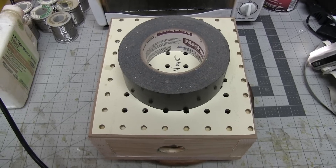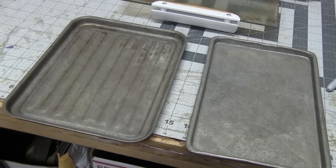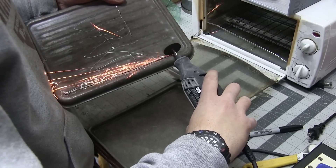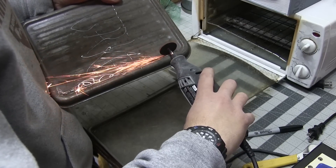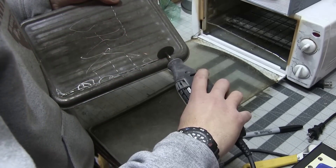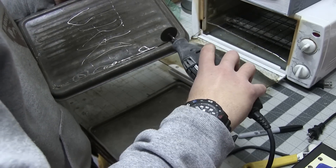Just to make it even more airtight, I wrapped it in duct tape. I cut up old toaster oven trays to use as a frame for the smaller platform — this will eventually hold the plastic sheets. Some people like to attach the frame to the platform with hinges, but I think that makes it harder to get a good seal. The really professional industrial ones actually have the trays attached above the platform via guide rails, but that's not necessary for one this small.